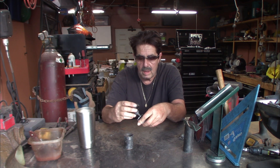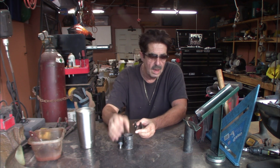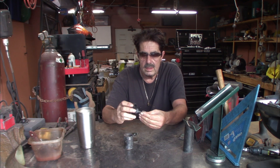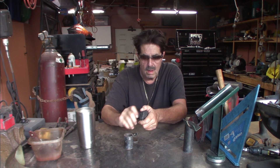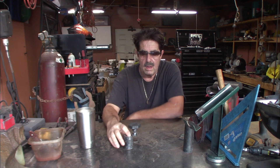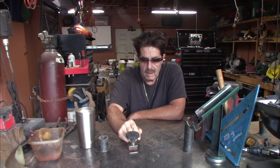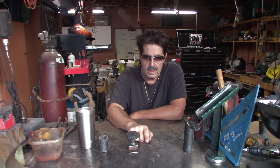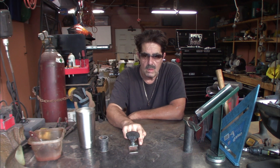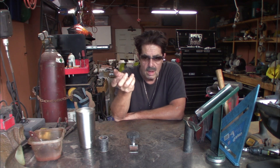You've got this handle piece, and I'm going to put the nut on here like this and screw it down quite a ways, then set it on there. I'm going to put a weld here and a weld here with my MIG gun — something like that. It holds the nut onto the piece of channel or rectangular steel nice and tight, and that creates the handle you're going to secure to the bottom of a workbench. If you have a very wide workbench, you'll want a wider piece of rectangular or channel steel.